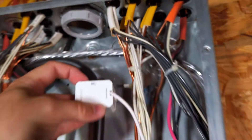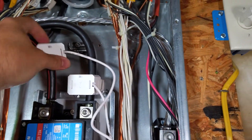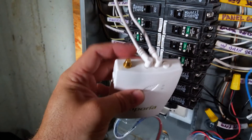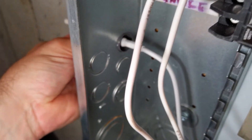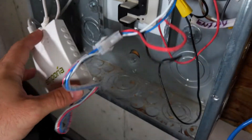Going up to where it's insulated, go ahead and wrap and connect the wire. There's the first one — noting the direction, clip it over and keep hands clear. Make sure to leave the insulation plug on the third phase, remove the first two, and connect them in. Now we're going to install the Wi-Fi antenna in the side of the panel. Locate a compatible sized knockout and punch that through. Then place the antenna in the slot and press it in until it locks into place. When connecting the antenna to the base unit, pull the cover away from the connector, screw it down until it's tight, then replace the cover to protect it from interference.